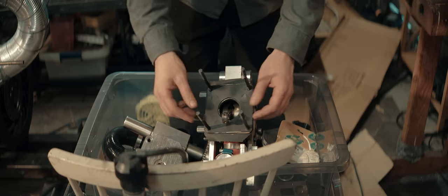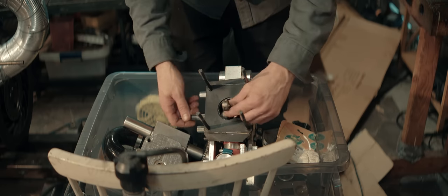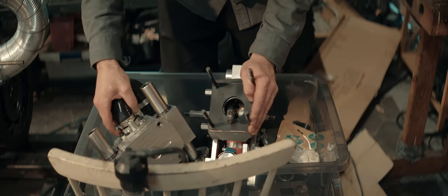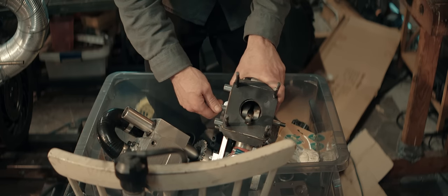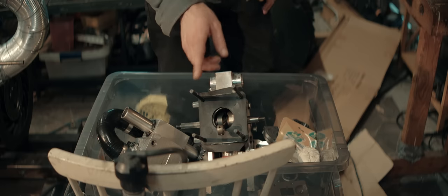Well, you see, I reused the piston from the brute force engine because that was the only piston I had on hand that would fit. Not only did this brute force engine run with a 0.5 millimeter squish gap, it also developed slack in one of the crank bearings. Recipe for hitting the head. That's what might have happened.